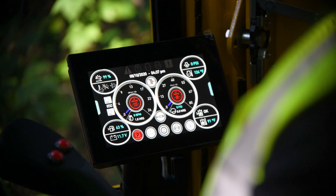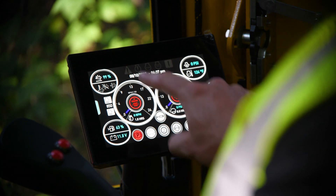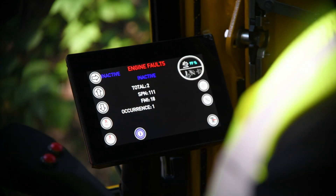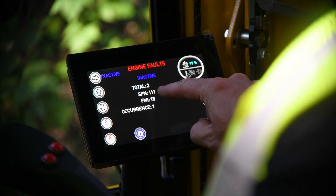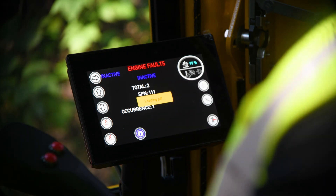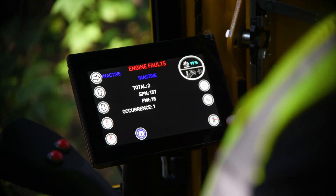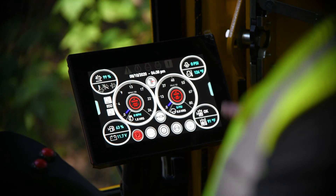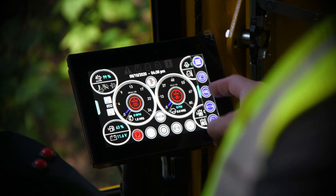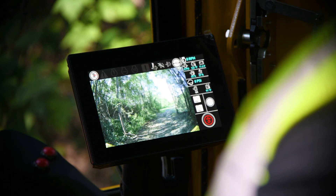Across the top of the display, there are some icons. The far left one is a triangle with an exclamation point in it. If that is flashing and you touch that spot, it'll bring up the fault codes for the engine. On that page, it'll list the fault codes — you can scroll through them, and once you have them written down, you can click another button which takes you to a PDF where you can read what your fault codes are and help determine how to troubleshoot engine errors. On the right-hand side, if you push the slide out, you'll have access to the menu in the display, where you can also access the backup camera to make sure it's working.